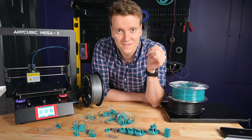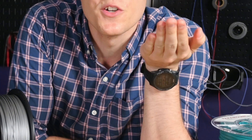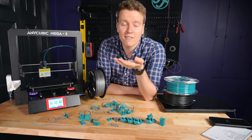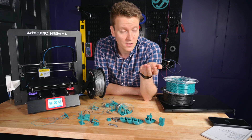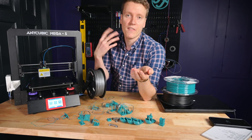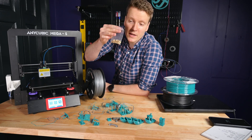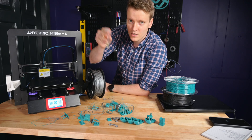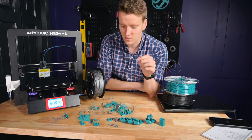You want to know what it is? It's something really small, right here in my hand — your nozzle. Change your nozzle if you haven't in a while and you're trying to print PETG. If you're getting inconsistent results, if it works sometimes and then you get a failed print but you didn't change the settings, just change your nozzle. Get a big pack of these and when it clogs, when you get inconsistent results, all of a sudden settings used to work and now they don't — just change your nozzle.